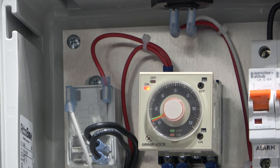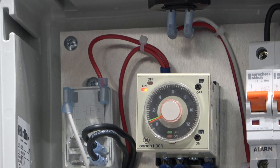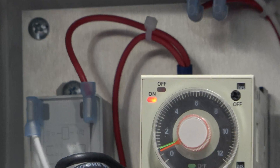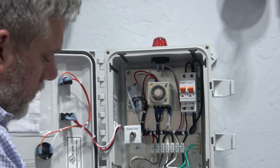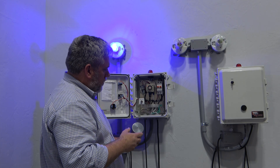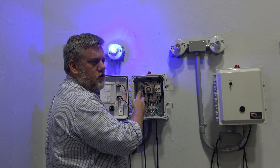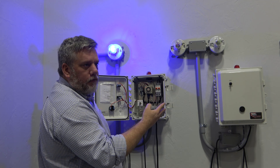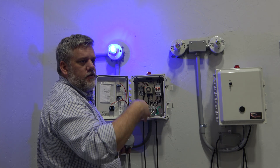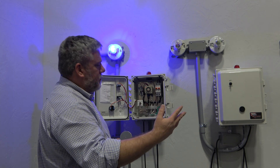You'll notice the light is not on — in order to engage, the float still has to be in the on position. We get some questions where people say 'is it going to run no matter what?' No, that's not the case. The float has to be engaged, and then it will dose for a set amount of time. On hours — you would probably never do that. Usually it's an hour off and then 30 seconds on, because you're trying to dose 500 gallons or 750 gallons, having an on/off period.